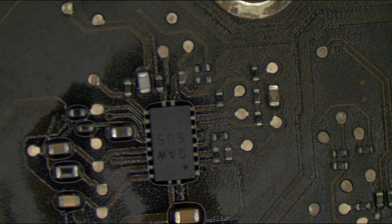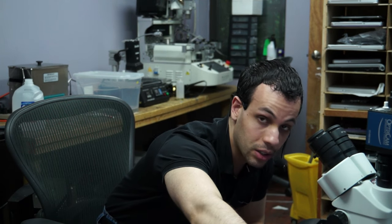Look at this board - it is clean. It looks perfect. Do you think that board with all that blue crap on it would have worked? No. And this is so important: the Crest costs less money but it's just a good device, something you should have in your repair store. If Branson - a top name in ultrasonic cleaning - can leave a board looking that bad after 30 minutes, imagine what a $50 or $100 jewelry cleaner is doing. That board spent 30 minutes in the Branson and came out looking terrible. It spent three minutes in the Crest and came out looking beautiful. I'm not arguing because I get paid by them - I want you to avoid the mistakes I've made over the past 17 years.